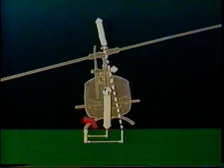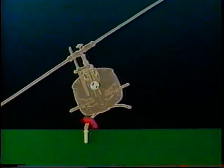The weight of the aircraft is doing less good because its rightward roll moment, which should be a stabilizing force, is acting over an arm that is decreasing in length. The net result is a powerful impulse driving the aircraft to roll left. Assuming no corrective action is taken, let's see what happens. Plainly, more of the same. Due to left cyclic, main rotor blade strike occurs much earlier.